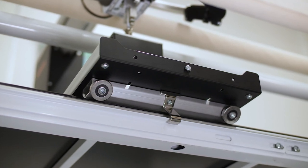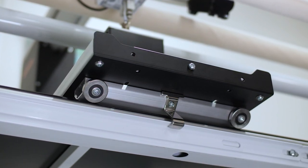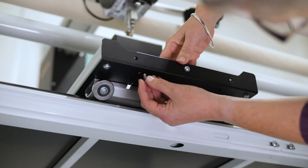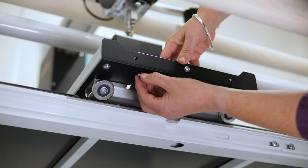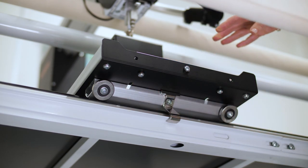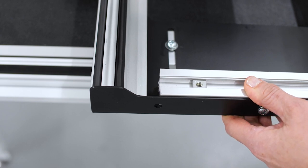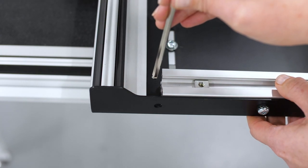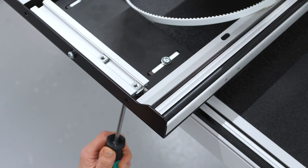Make sure the other two nuts in the bottom groove are positioned close to the left and right opening in the carriage. Provide a screw with a serrated lock washer and additional washer, insert it through the left opening into the nut, tighten by hand, and repeat for the right side. As a last step before tightening, adjust the profile on the carriage, making sure it is 5mm — a scant quarter inch — away from the left edge. Use your 5mm allen key to measure the distance — no measuring or guesswork involved. Tighten all screws well.